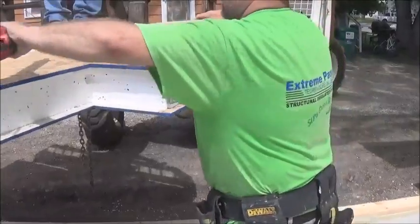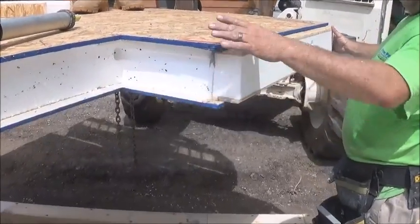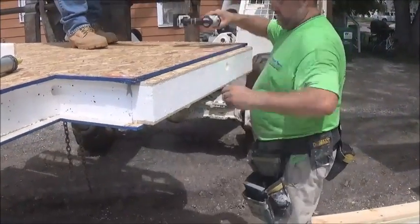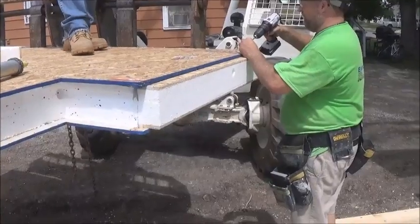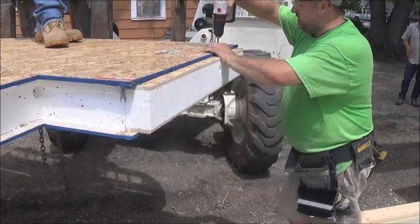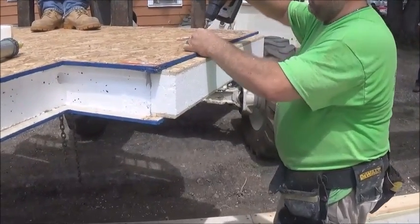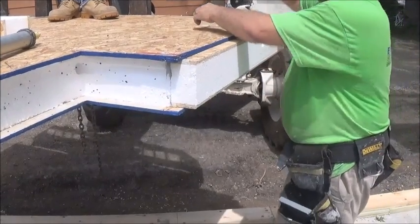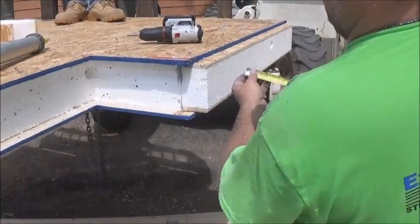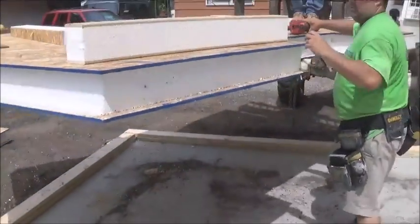Making sure your electrical chase is always toward the inside of the wall, and we're flushing that up with the foam. We're simply going to screw these every six to eight inches on center. If we were stapling, we'd be doing three to four inches; if nailing, six inches; and we can go six to eight with screws. Just pushing it in to make sure you've got that inch and a half gap — which we're perfect, everything's an inch and a half — and we'll do the bottom of that one shortly.